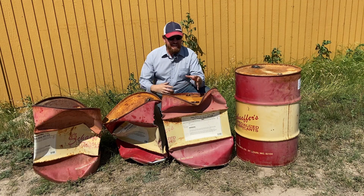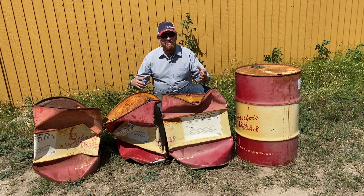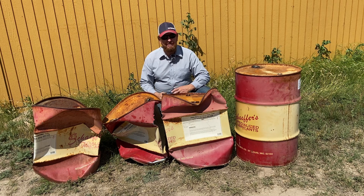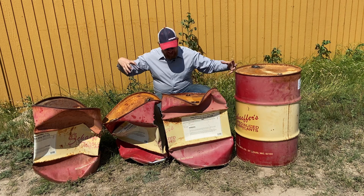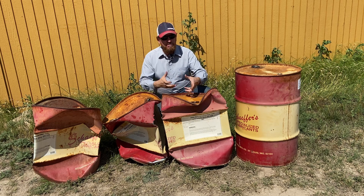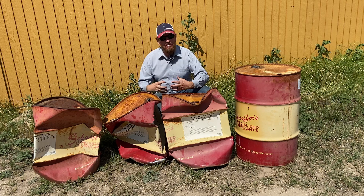What I really want you to understand is vacuum isn't a thing sucking these molecules in — it's a pressure difference. It's the atmospheric pressure, 14.7 psi at sea level — here it was about 13-point-something psi. For every square inch, there's 13 pounds pushing against it. It's the atmospheric pressure that's pushing and causing these to crush in. We're removing the pressure from the inside, and it's the air pressure on the outside that's pushing this in.